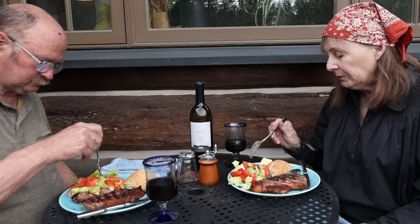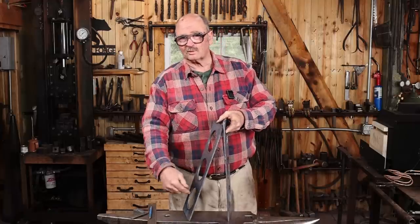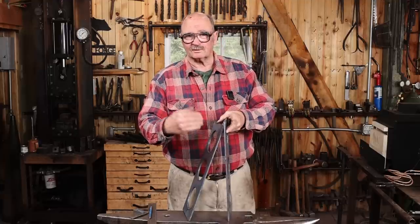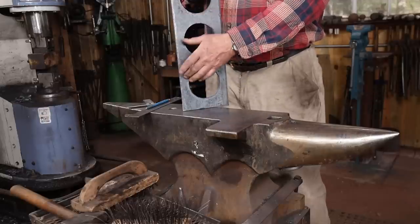To space the front and the back of the wine rack, I'm going to put some round rods in. Those will be tenoned through, so I need to drill a bunch of holes through here. You could punch the holes, but I want to go for the accuracy of drilled holes. I think 4 sets of rods will look best, top, bottom, and between the holes on the side, and that'll be 4, 8 total.